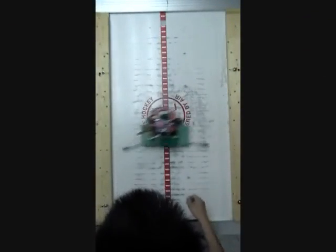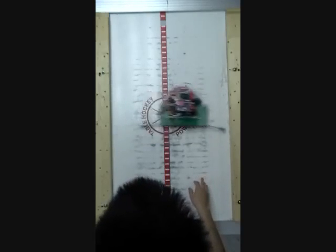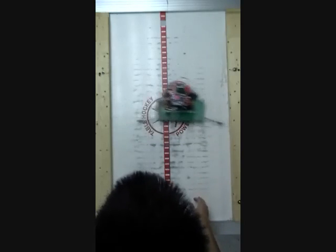This experiment shows how the vertical height of the robot can be stabilized. We determine the height error from the IR tracking data at touchdown and use a PID controller to determine the energy input for the next touchdown.